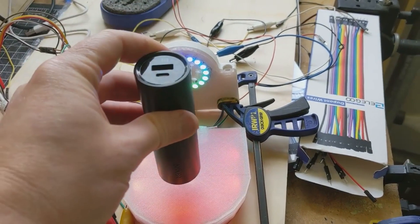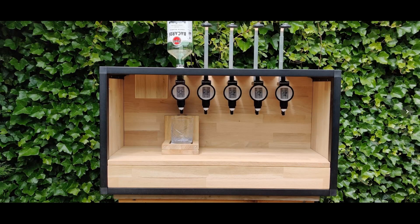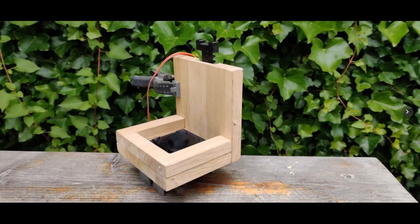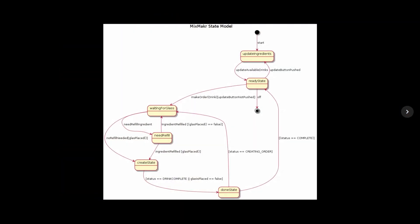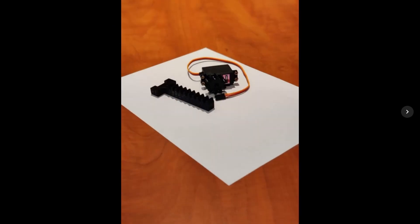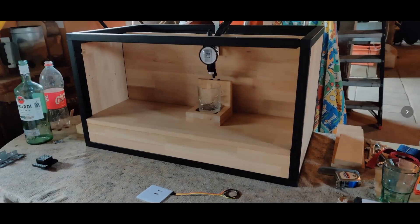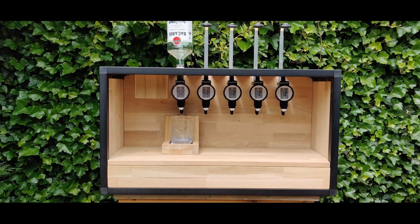I'm currently obsessed with a cocktail robotics project and always on the lookout for new solutions. This Mixmaker cocktail machine by a team from the Netherlands is one of the first designs to catch my attention in a while. It's essentially a Pi-based system where the Pi takes orders over a locally hosted interface you can access from your phone. A concealed stepper motor pulls your drink along a track as each ingredient is poured. There's one pump for slowly pouring soda, but the rest come out of dispensers where the bottle mounts on top. The smart thing this team did was mount a servo on the back of the cup holder with a linear gear that shoves up into the dispenser to get it to pour — it's a lot faster than using pumps and looks cooler too.